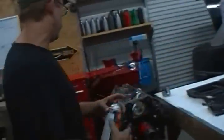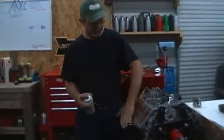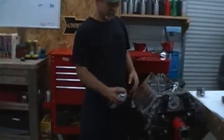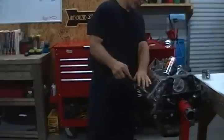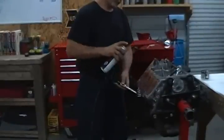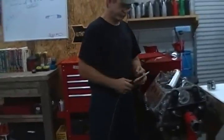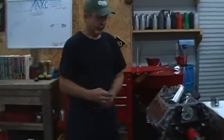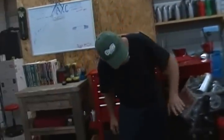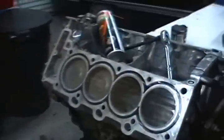At this point we're going to begin to use brake cleaner to get the hole clean — we're going to be real generous with it. We want to make sure you understand that until you feel confident that the hole is clean, get it out as much as you want. That stuff will dry up really quick, clean it out with no residue behind. Looks great — it's a beautiful cut, clean, tapped out nice. At that point I feel confident to move on to inserting the product.